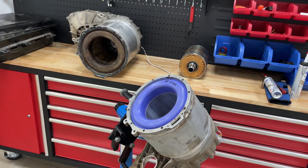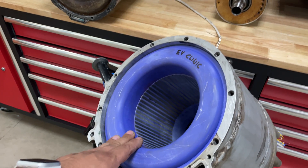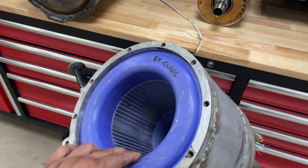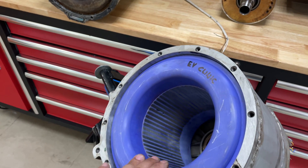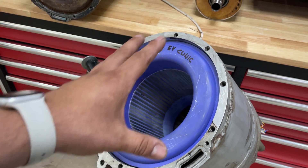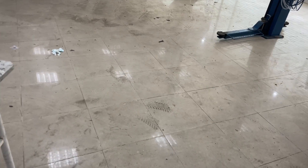With this type of thermally conductive epoxy, it is purpose-made to dissipate heat easily, prevent overheating of the windings, and prevent any coolant ingress. Now if coolant gets inside, it cannot damage the windings of the stator phases.